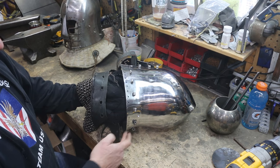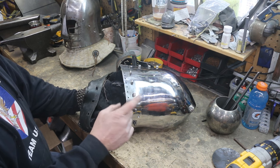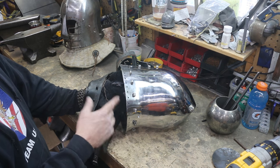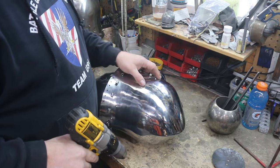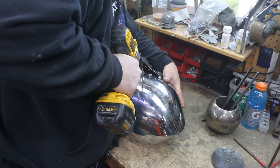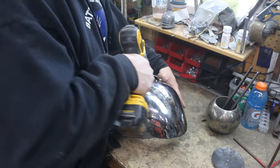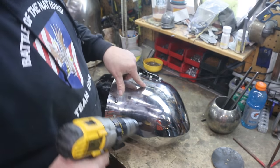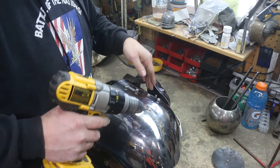I was trying to leave the back stitched in and it just came out on its own. When you stitch in your own liner it's a really good idea to only do a couple of holes and then tie it off and then start another one. That way if a thread cuts or is broken, everything doesn't unravel. So we've got the start done on those holes. I'm going to have to finish this off with a hand drill because it's been challenging on the drill press. At this point you want to be careful not to go too far — you can drill through the rivet and then the edge of the chuck can go and scratch the helmet itself. So I'm taking some care to make sure that doesn't happen.